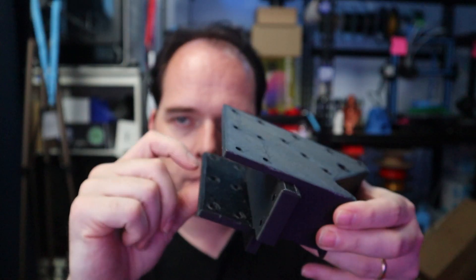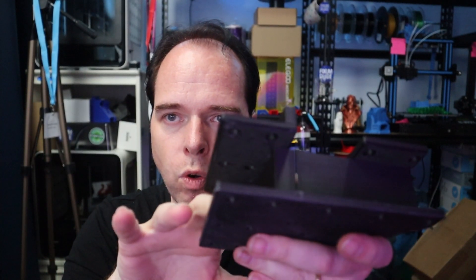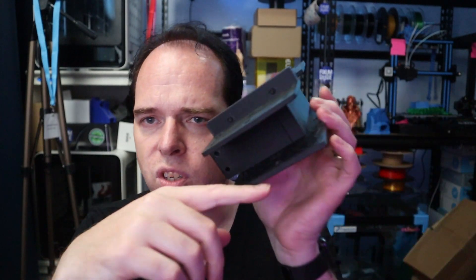As you can see, removal of the support can be very easy or very difficult depending on the type of support you choose. With tree support it is possible, but make sure the top sides of the part look as good as possible. The strength is decent — eventually both sides are going to be supported, and when attached it will clamp onto the extrusion.